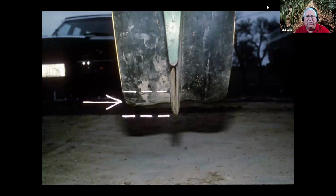The double disc opener on the planter has blade contact not at the bottom of the seed V, it's right up front at ground level. Those 2 discs work together to cut, open up that seed V, and that residue is nicely cut for you. Those 2 openers working together are sharper than any coulter I found on the market. And they're only running a couple inches deep. They're not running 5, 6 inches deep like they used to run them. So again, it's easy to go with the double disc opener and go out there and no-till.